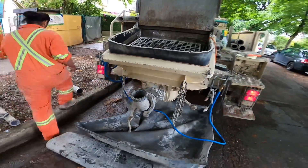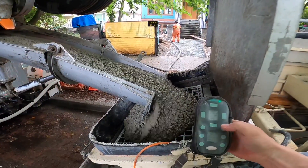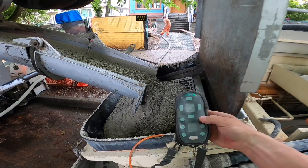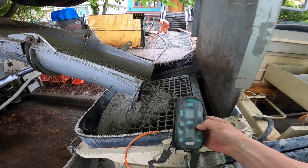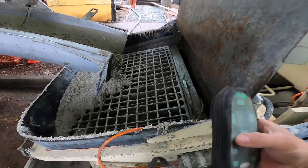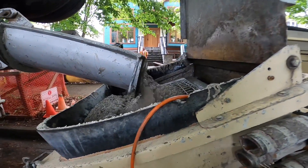Button this up, connect it up, and we'll catch you on the prime here. When I prime, I start with my volume at zero, turn the pump on and forward, increase the volume ever so slightly until I find that happy speed — and I think we're about there. I'll put my auger in the proper direction.